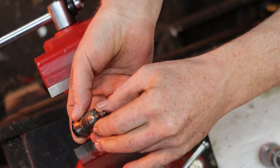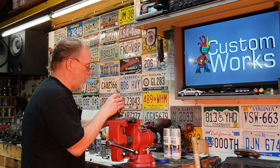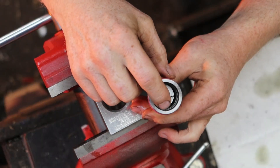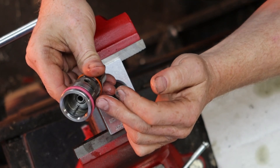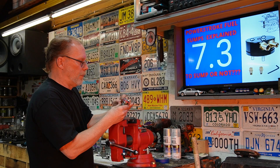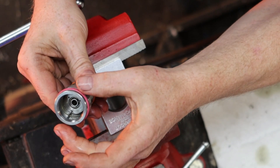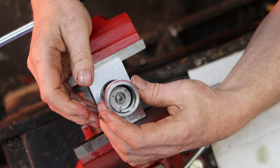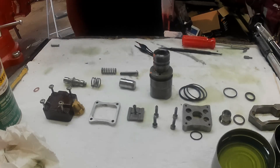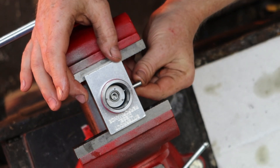We take it, we invert it. We take our barrel and slide it up into place - make sure that your pins didn't fall out. Now I've already pre-done this just for the speed of the video, but beforehand put your o-rings on. It's much easier to do it right now; chances of nicking them is very minimal to absolutely none.